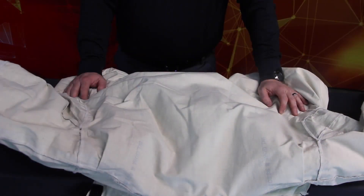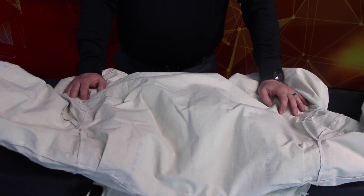If you find any, note it on the inspection form. Discoloration, significant changes in material texture, and loss of material strength can be signs of UV, heat, or chemical degradation. If you discover any damage on the face cloth of your thermal liner or on the substrate of the moisture barrier, document it on the inspection form and mark it for either additional testing or repair.